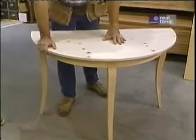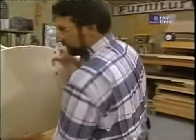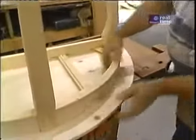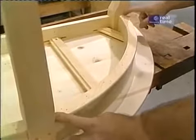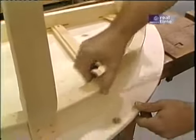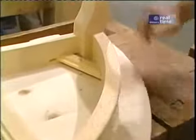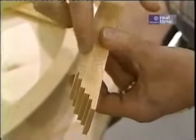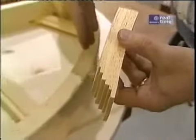The frame and the legs are all made from a clear pine. I did make a couple of significant construction detail changes. On the antique original, the curved rails were cut from a single piece of wood — and that's very weak, particularly at the ends where the tenons are, the most important part. This rail looks like it's been cut from a single piece of wood, but this is just a decorative molding sitting on top of the rail, which I made from six pieces of wood, glued and laminated together to form the shape of the curve.